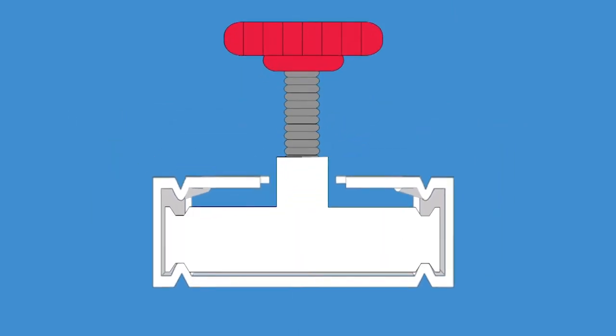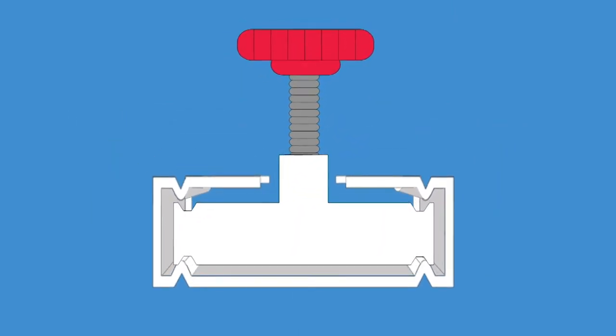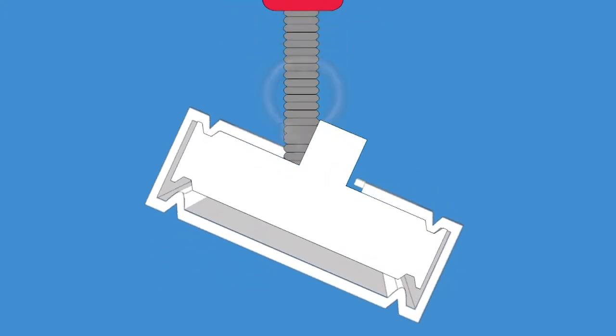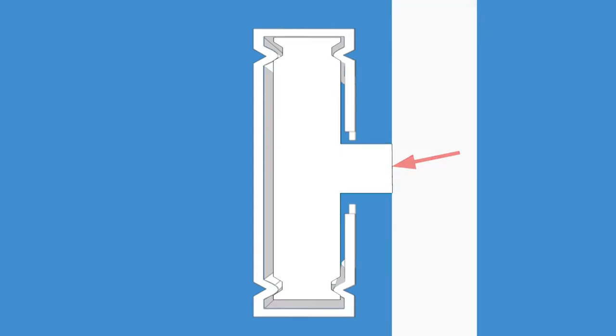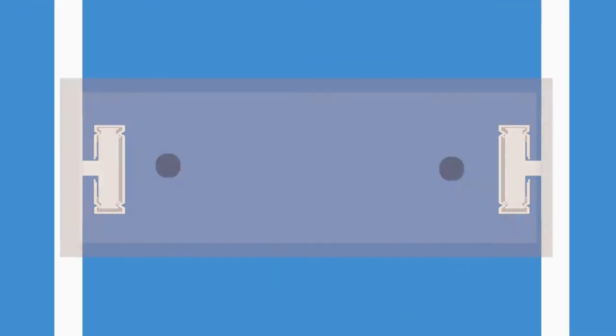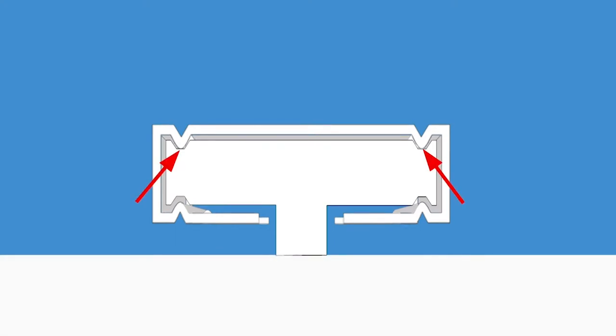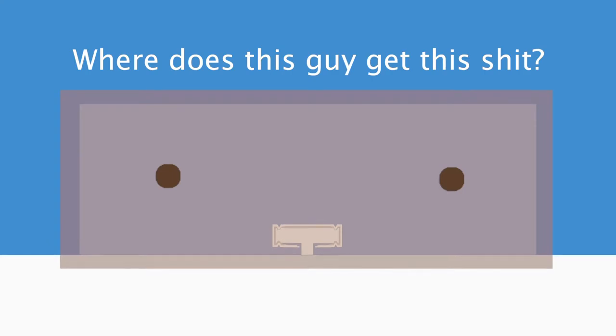This same track can be used to attach anchor blocks, which slide up and down the track, lock anywhere in place, and have accessories attached. The track can be mounted vertically. In this configuration, the outer track rides on the sides of its rails on the inner slide. This could possibly be a replacement for drawer slides in some applications. The track can also be mounted at an angle should the need arise, with the inner slide mount riding on the lower two rails. Mounting the track assembly horizontally, with the inner slide as the base, could possibly replace undermount drawer slides in some applications.